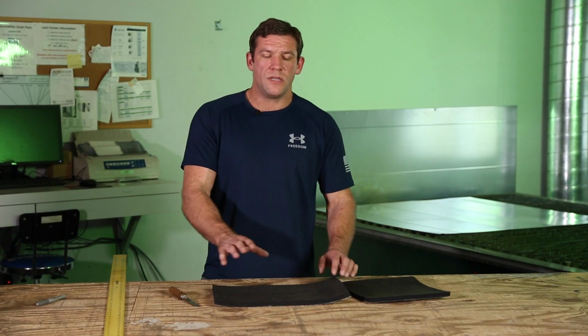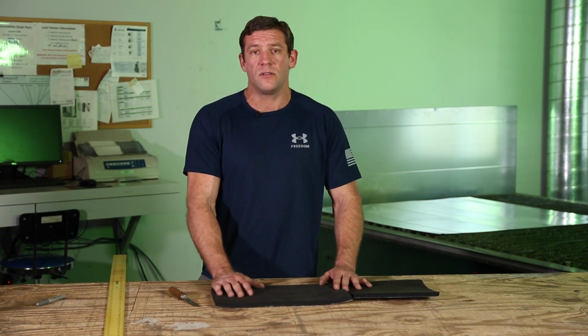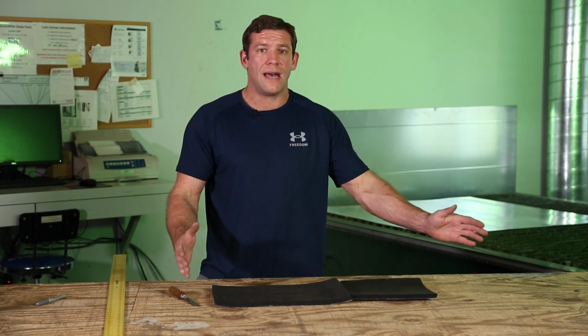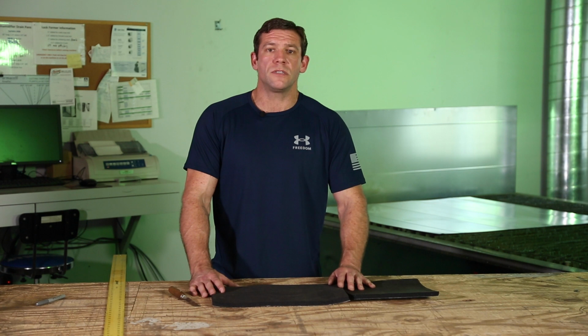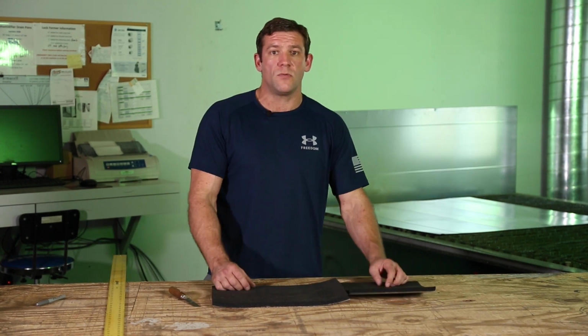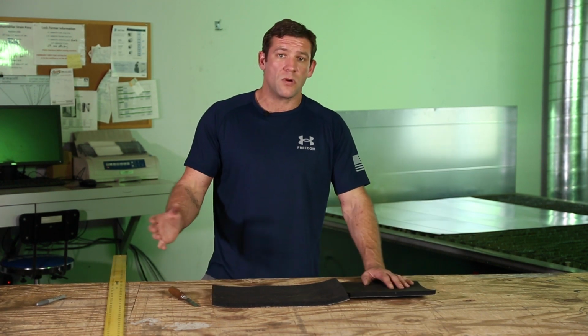Assembly line process can be used for lining ductwork, but because the material cost is so high, you absolutely need to check your pattern sizes and make sure they work out before you cut 10 patterns and then line 10 pieces of duct. But with everything in heat and air, assembly line process can be used to increase production and work smarter, not harder. You can cut 10 patterns at one time and then line 10 pieces of duct at one time. You'd probably save 40% of your time if you do it this way. But if you screw up and you cut 10 patterns that are the wrong size, you've got a lot of loss of material.